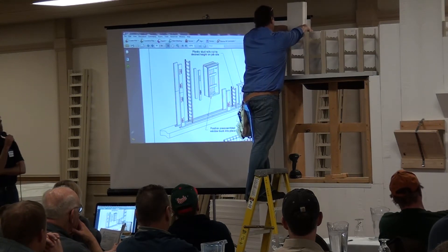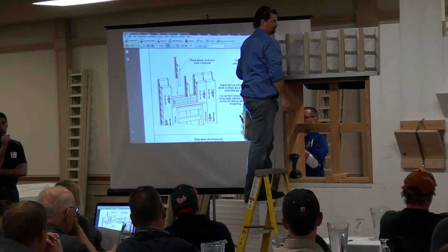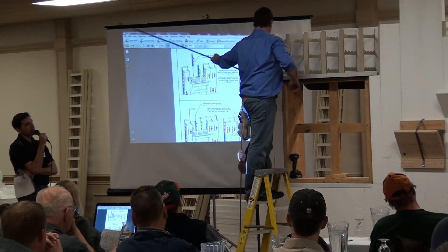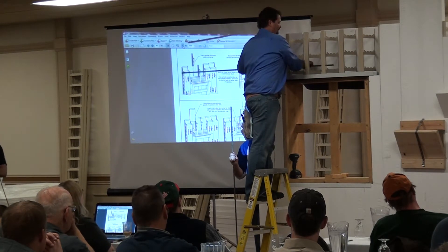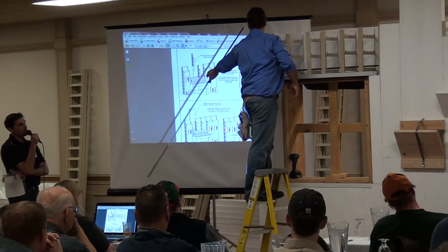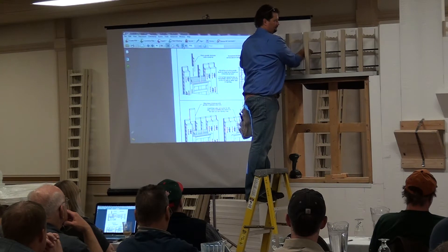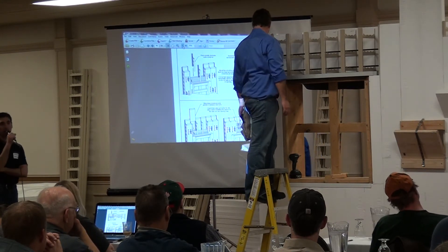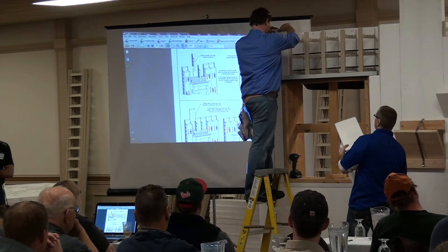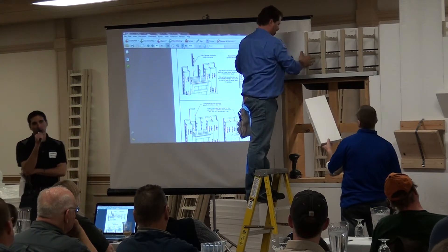You can see Jerry's building one side above the opening, which gives full access for installing the reinforcing needed above. You may need what are called stirrups in that lintel — a bar close to the top of the wood and a bar at the top of the wall, connected in a C-shape or S-shape. Stirrups are required when engineering tells us we have a large span opening that needs protection from sagging.